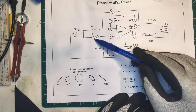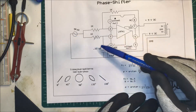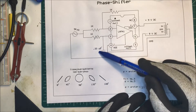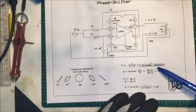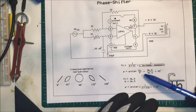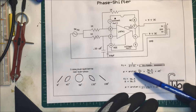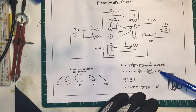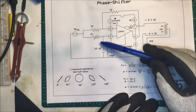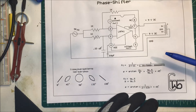For this resistance in series with this, I have my 5k. To find the capacitive reactance of this we just use that old formula, and that comes out to about 96 ohms of capacitive reactance. If we divide that by resistance — 96 divided by 96 — that's going to be 1. Arctangent of 1 is equal to 45 degrees. So with 100 ohms or so I should be able to get a phase angle of 45 degrees.